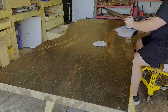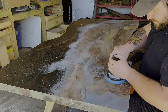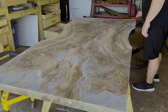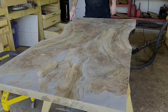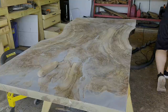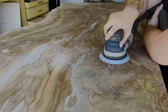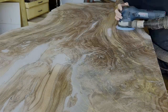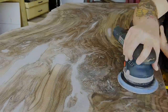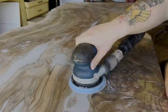Once that epoxy dried, it was time to start sanding everything off. It's really important to note that you have to sand off the sealed sides at the same time - you can't just unseal the top and leave the bottom sealed because that's going to cause issues for you later on. It's kind of out of sight, out of mind, but very important. With the soft areas stabilized, I started sanding from 80 grit all the way up to 220 grit, then stopped to put my roundovers on.